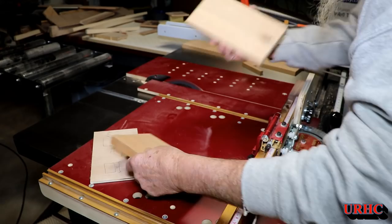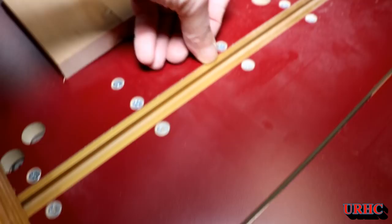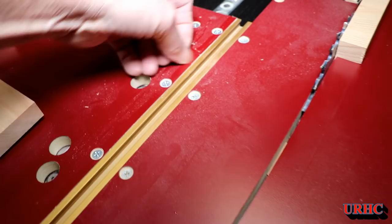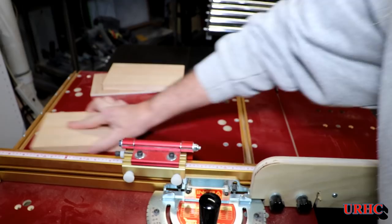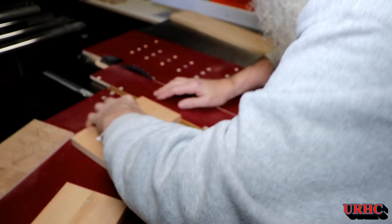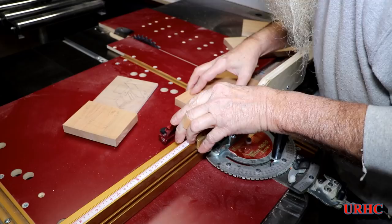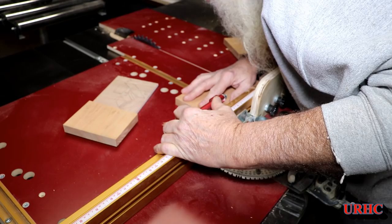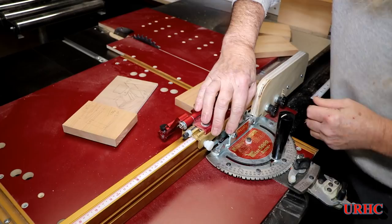Once I got the parts cut and tried fitting them together with a square, nothing lined up perfectly. Here's what's happening: that center board is actually starting to warp up between those screw holes — it looks like it's expanding. I've got raised sections that cause it to rock. For some reason, that board on the left is puffing up in the middle like it's made out of cardboard, while the other two are still perfectly flat. It looks like they must have used some really cheap material. I'm going to have to get some Baltic birch plywood and replace those panels because they're junk and they're making it inaccurate.